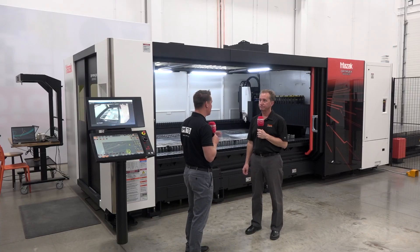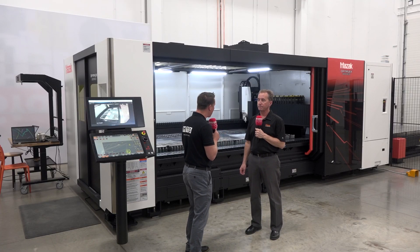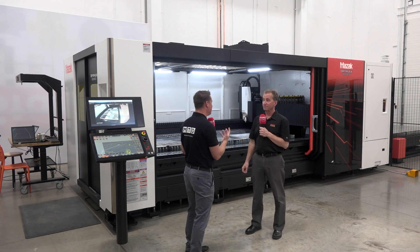When we go faster, we can make parts quicker. And with some of your other machines, we're looking at 32 millimeter. What are we jumping up to on thickness with even the harder materials on this NIO machine? When we get into those high tensile strengths — such as stainless steel, even Inconels or titaniums — we can always go up to 25 millimeter. But in this case, we can double that thickness, go up to 50 millimeter thickness on stainless steel.